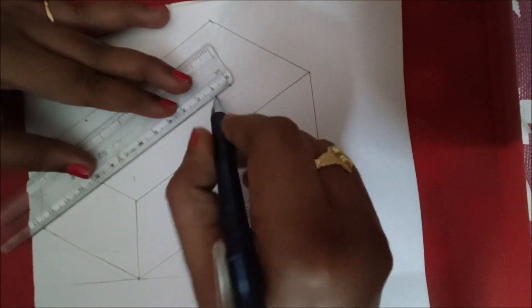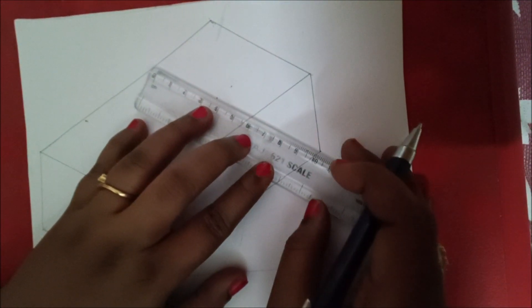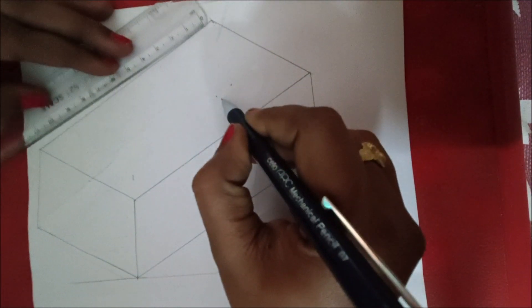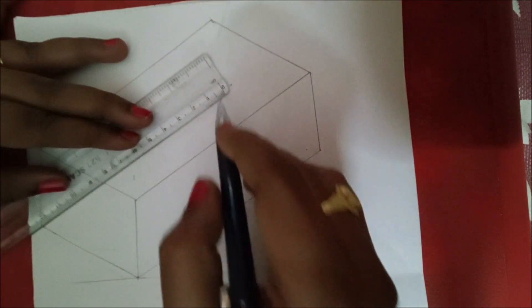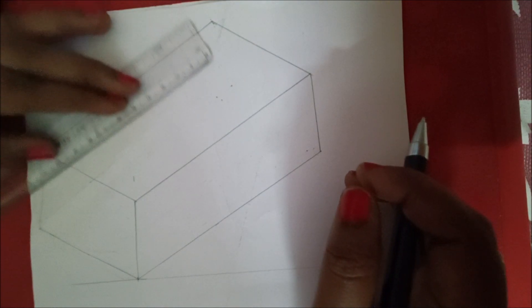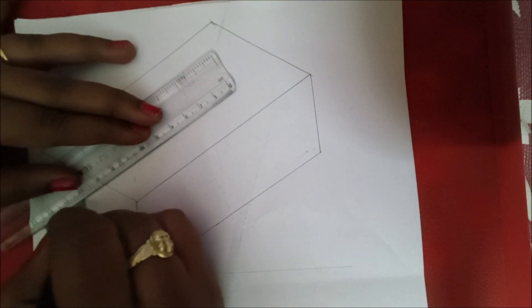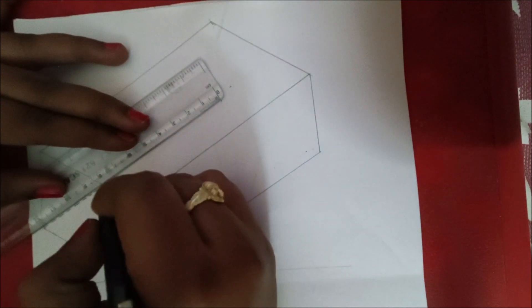Mark the points along this parallel line. Make a point from here to where it ends at 60 mm so that you get the line. Now it is parallel to this line — mark the point here. On this side also it should be parallel to these lines. Check the parallel on every side and mark 120 mm. As it is on the inner side it is not visible, so draw with dotted lines; wherever it is showing, draw with a continuous straight line — completely 120 mm.